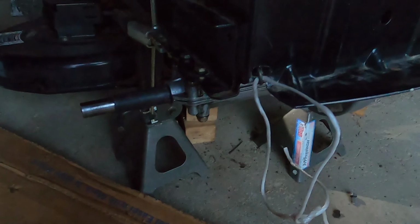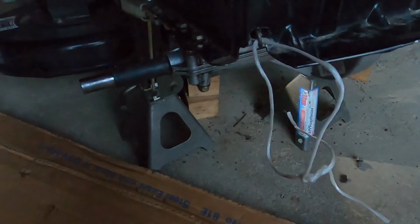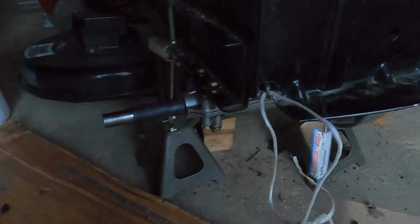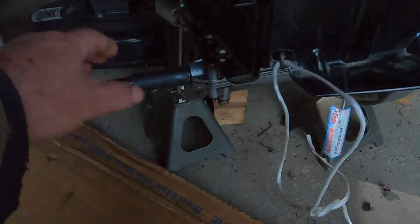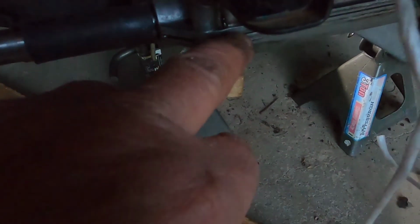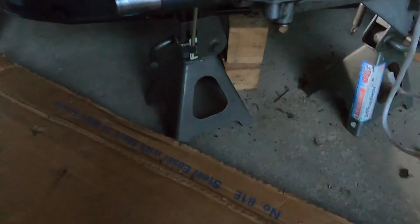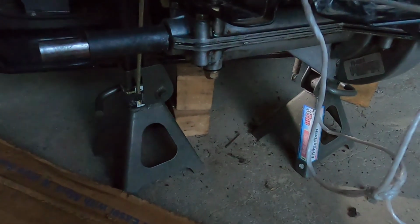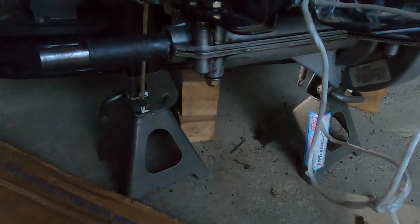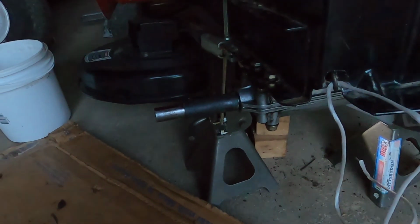Well, all I have left is to get those two bolts in, put the ties on. The transmission's working. It shouldn't be jumping out of gear, and the reason I know it's working, I connected a drill to it, and I made sure the axle was able to go forward and reverse. Whether it jumps out of gear, we'll see. My biggest concern is that they don't have any sealant between the two halves of the transmission. I find that kind of odd, but we'll see what happens. And I just used a little under a quart of that 00 grease. I'm not sure if it's enough, too much, but time will tell.